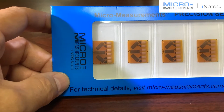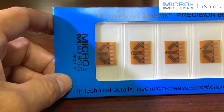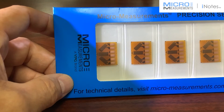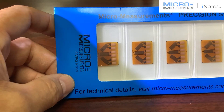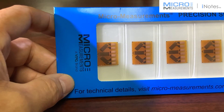This new version has the advanced sensors technology built into the strain gauge, which is a new technology that we use for adjustment of the gauge. There are two main advantages: number one, the resistance tolerance of the grids is tighter than it has been traditionally; number two, we get better matching from one gauge to the next with these new adjustment techniques.